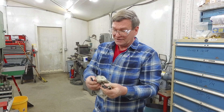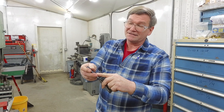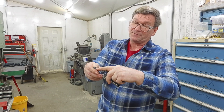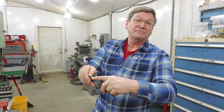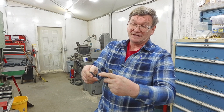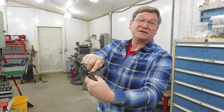The most common tap we use is a plug tap. A plug tap has a medium amount of taper — maybe three or four threads that are tapered off for the cut, as opposed to the taper tap where you have six or seven tapered threads.